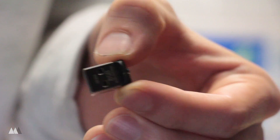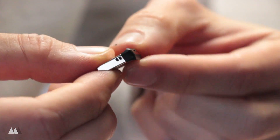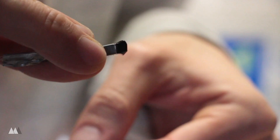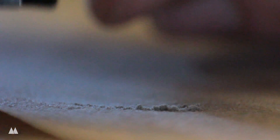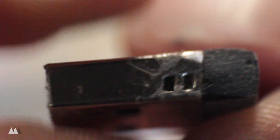So here are these tiny SanDisk flash drives that I bought on Amazon. To make them as small as possible, I'm going to sand off all of the unnecessary plastic bits. I use duct tape to protect the actual part that plugs into the computer while I'm sanding, and it also gives me a little bit more to hold onto. I'm using 150 grit sandpaper right at the edge of my workbench so that I only get that plastic part sanded down, and I'm trying to avoid sanding the metal as much as possible. I sanded as much as I could on every side including the top — might as well make it as small as we can. With 3D printing, the case has to be a little thicker than if we were using an injection molded casing.